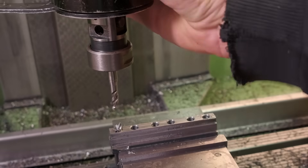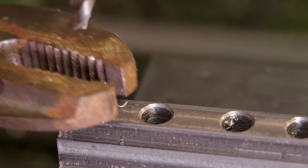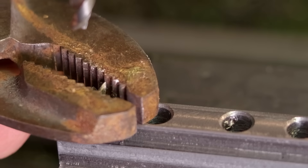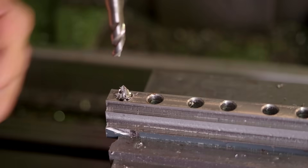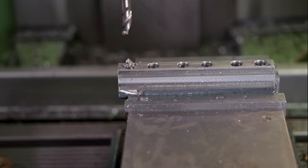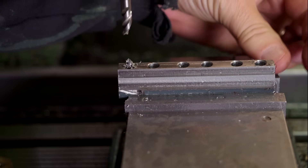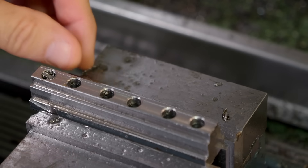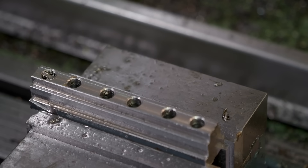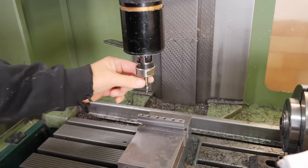It's really not ideal. I wonder if it's got any interest in moving back out. It's about now that you realize if I'd made this bar just one nut longer it would have been almost no extra effort up to this stage. I'm not sure whether that tap was a bit blunt or something wrong with my toolpath there. Either way, it's dead. I wonder if that tap was already damaged — I didn't actually look at it before I used it.